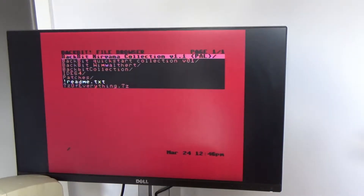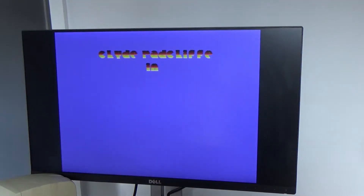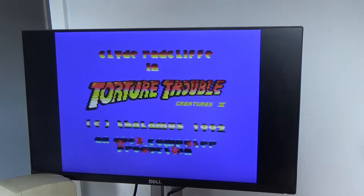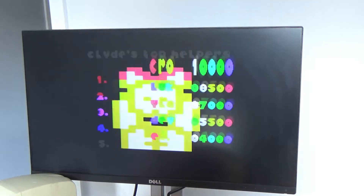Before we had some problems - I think X-Out or Cross-Out didn't work. So let's try that, see if it now loads because it certainly didn't before. I think Creatures 2 didn't load as well. Oh, there we go! So this did not load before. That CIA chip, even when it was loading off the back bit cartridge, was having an effect because it was in the slot where it was affecting the actual loading. So this is now working and it didn't before. Excellent.